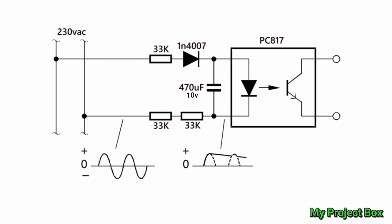To make a practical circuit, instead of using one resistor I use three connected in series, which spreads the heat dissipation. The voltage rating of quarter-watt resistors isn't suitable for just one, but with three in series it's fine and it spreads the voltage rating. The capacitor to smooth it out is a 470 microfarad capacitor - the voltage rating doesn't have to be for mains voltage because it's limited by the forward voltage of the LED. It's a 1N4007 rectifier diode, and the optocoupler is the very common PC817, used in switch-mode power supplies - they're dirt cheap to buy.